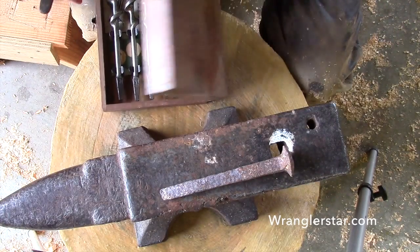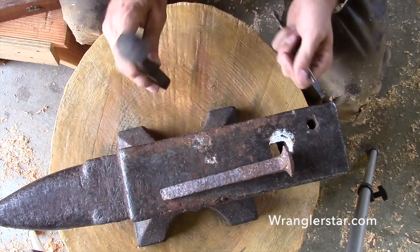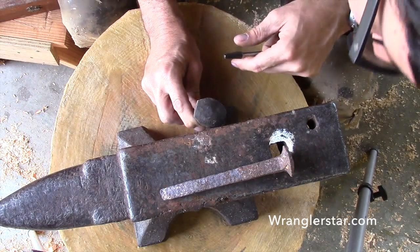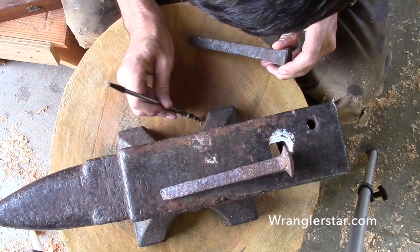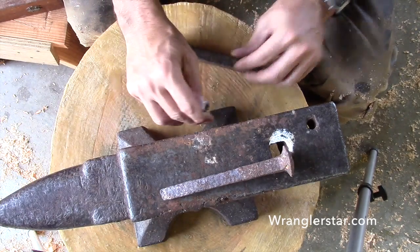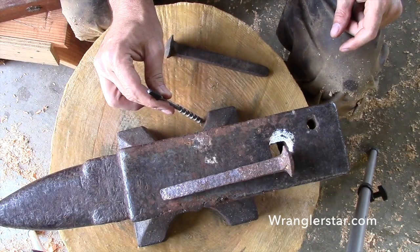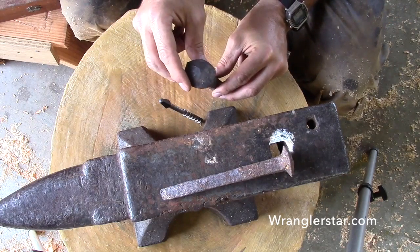Let's go with the three-eighths — I think that will be just fine. We want to go across the grain as much as we can, which isn't going to be perfectly across the grain, but it will be kind of at 45. We want to have room to pound it in. If we drilled that hole right about there, that'd be right in the center — just about ideal, straight down. If we drilled it at an angle, it would be a little bit stronger and harder to pull out, but it might not come in contact as well.